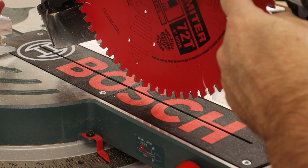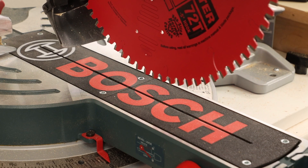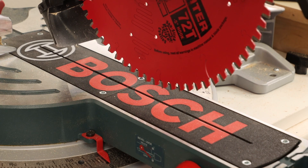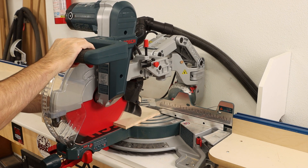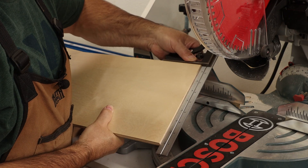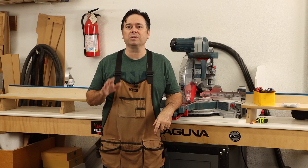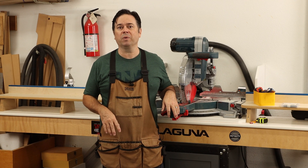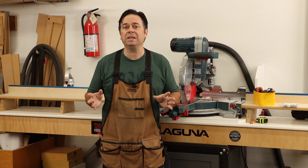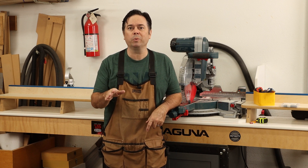Even with a fair amount of lateral pressure I'm not seeing hardly any deflection now, and it's cutting nice and true. The one thing you might need to recheck is your 90-degree stop setting, which is covered in my precision setup video in the description. If you're willing to do a little troubleshooting you can easily determine the source of any inaccuracy — whether that's the miter lock detent system or looseness in the linkage of that axial glide system. Either way, it's pretty easy to fix. A quick thumbs up goes a long way, and remember to subscribe to The Thoughtful Woodworker so you don't miss the next video.